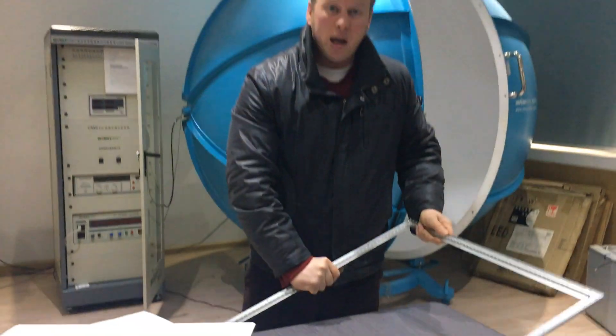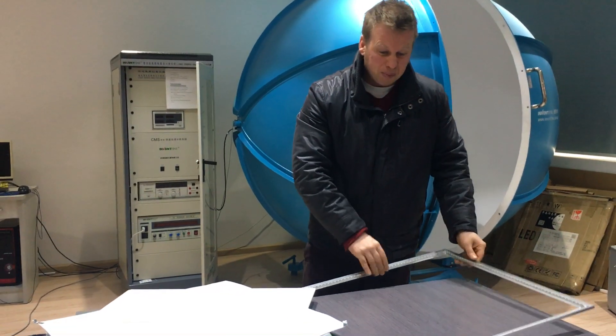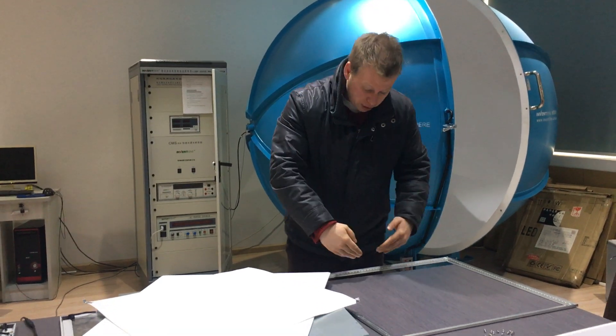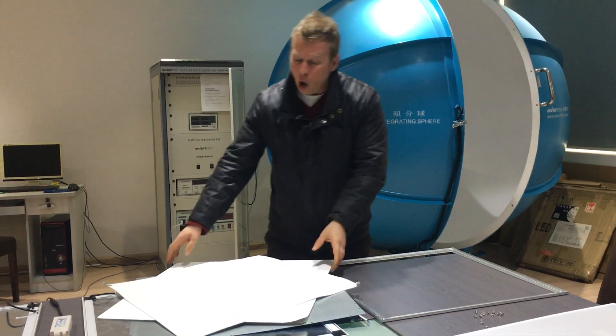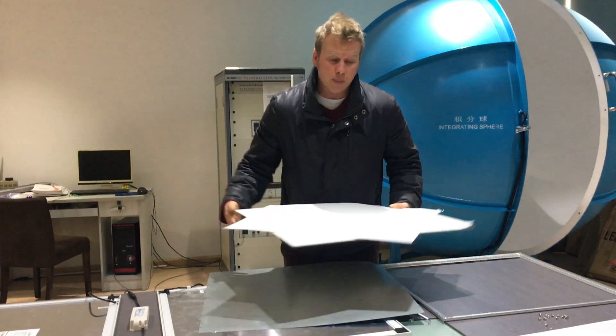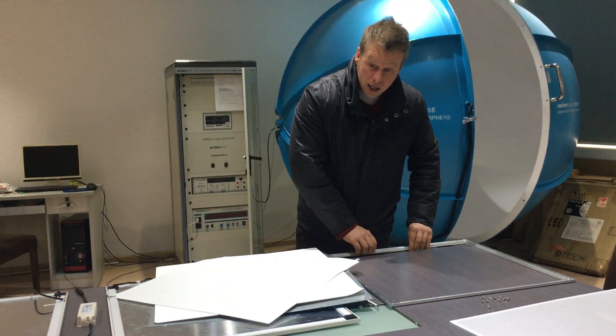The 4014 is a very narrow, long diode spaced on a very thin PCB into a very thin aluminium frame. This frame is very light — very, very simple. If you've got a narrow PCB with a 4014, the heat's coming back into this frame. It's not actually dissipating — it's not taking that heat out. So the heat stays in this frame.